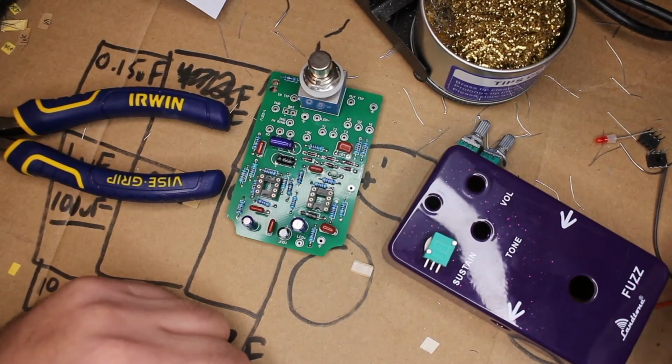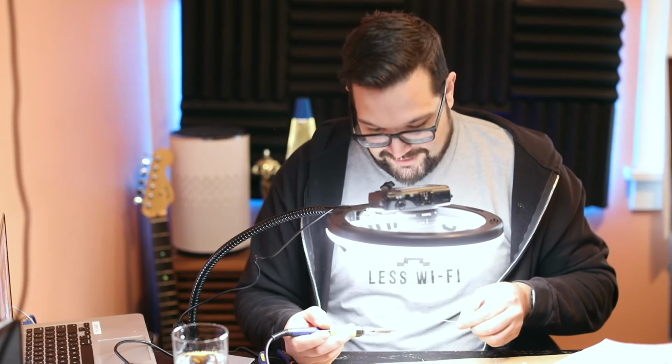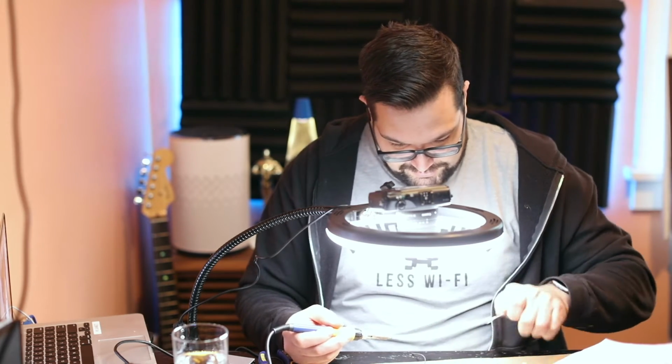Okay, we're gonna do something called tinning the lead. That sounds like a skate move. But actually what it is is getting enough solder onto the parts ahead of time so that when you introduce them together and heat them up, they stick together and you're not just shoving solder into it. So I am going to heat up. Is that in the frame? Nope. All right, let's move it over here a little bit.